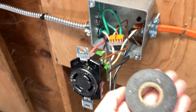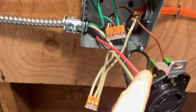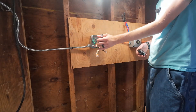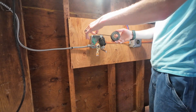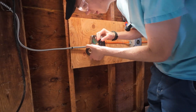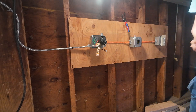Make sure you put electrical tape on there. On the sides, if something — or a person — touches those exposed screws, they'll get electrocuted. So make sure we cover that up. Take your 3M Super 88 electrical tape — don't get cheap brand electrical tape, buy the good stuff. Wrap it around the sides, cover up those screws. You don't want anything getting behind there, no fingers, no dust or debris. Cover it up. A lot safer now.